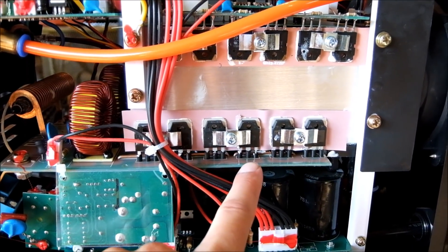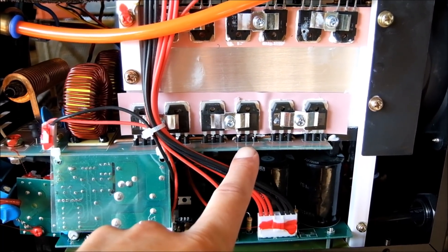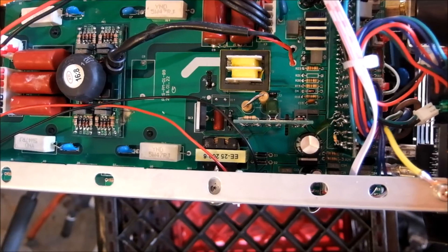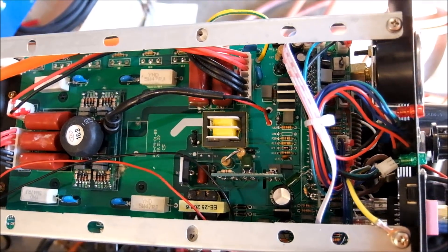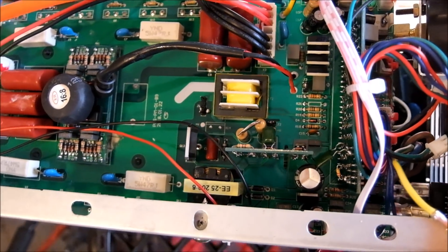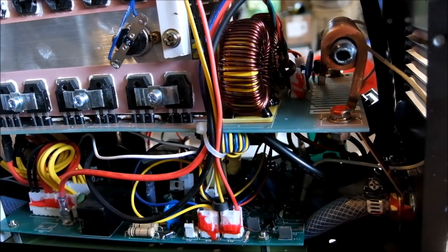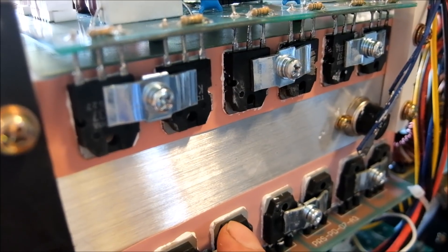For the pilot arc, you just have capacitors floating around, soldering onto backup boards, wires touching resistors — and resistors get pretty hot. Touch zone with the capacitor. They say these are Toshiba MOSFETs, but anybody can label something anything they want. I'm also afraid there might not be a good coating on here, so I'm going to hook up a filter on the vent fan. Even the terrible instructions say to blow it out with an air gun — you don't want a short circuit on this board. Fine metal particles are attracted to the board. I'm happy they at least put thermal paste on the components to conduct the heat.